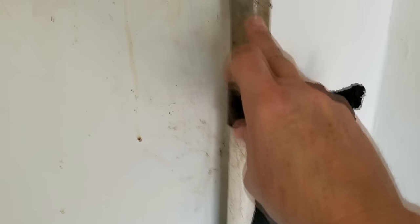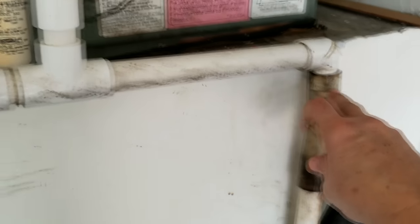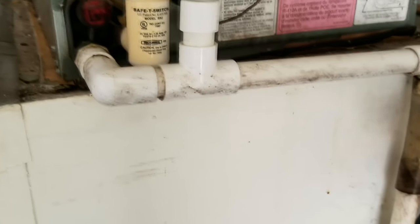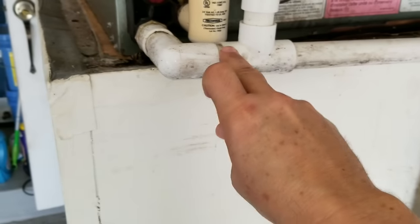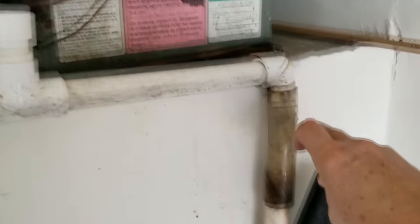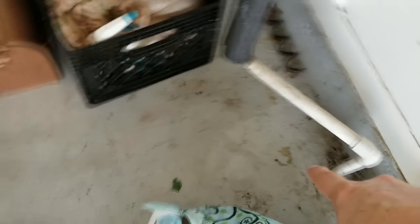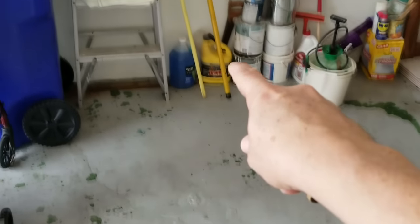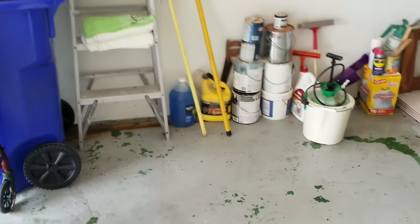As I look in here, this thing looks kind of filthy. Normally this is where we see our problems with the air conditioners — there's a clog in the line. This is the drain line, so all the condensation is supposed to go through this drain line down to the floor, and the way they did this one is it goes down into the slab and runs directly across the garage.